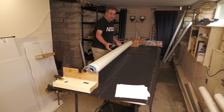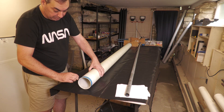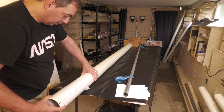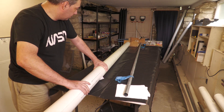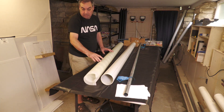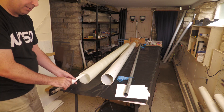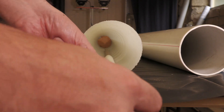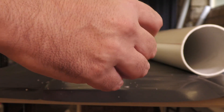The next day we can pull the tube off. It's a little bit more tricky because of that slight bend but you can just wiggle it off. Careful mandrel and paper prep are essential to get a tube of this size to slide off easily. Pulling the paper also needs to be done carefully because tearing it well inside the tube is a lot harder to remove. To make this easier we insert a long dowel down the length of the tube and start rolling — the paper then wraps itself onto the dowel, always pulling inwards towards the center, preventing tearing.